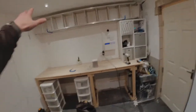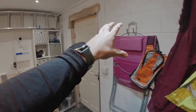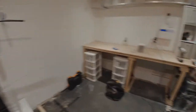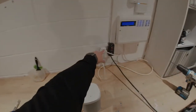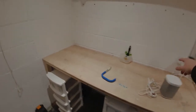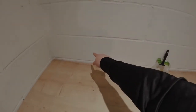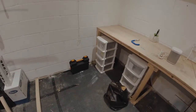I need to take the ladders out - they're going out of the garage. I need to move the alarm; it's going to go to the right-hand side over here. I need to start running some sockets around the outside here, so I'm probably going to have a couple of doubles along the side there. I'll supply these doubles off a spur from the main ring. I'm also going to run a cable, label it up, and bring a little bit of plastic conduit up the wall with some capping. Just behind the back of this breeze block is the board, so we'll run straight into the board with a spare cable and I'll label that up.